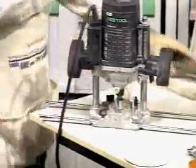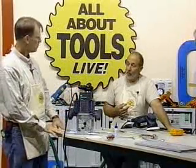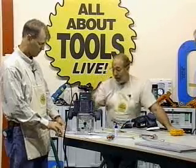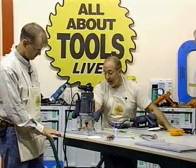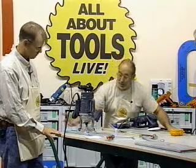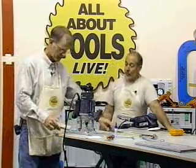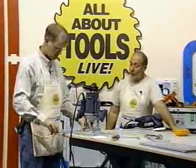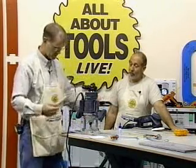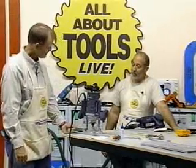Now, if you had to do a large area, let's say you were in the middle of a peninsula top like this, you could really just get longer rods that you could probably buy at a home center or hardware store. I think so. You're probably talking about maybe a 3/8 diameter rod, and these are ground flat on one side, but you wouldn't have to do that for that application. You could just slide it through and put one at each end of the island top. By once again using the synthetic shims underneath it, and at either end, even over a span of 36, 42 inches, wouldn't matter, placing the block across the top gives you the flat surface to clamp to.